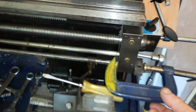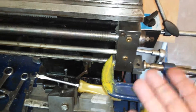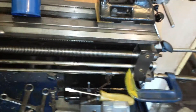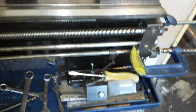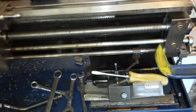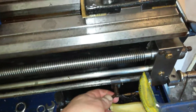Now it is on - I'm just holding it with a G-clamp for the moment. This is going to be hardened steel anyway, so this mild steel will be marred by the G-clamp, but the hardened steel will be fine. It's not the best thing for doing, but the fact of the matter is this shaft now is pretty sturdy.